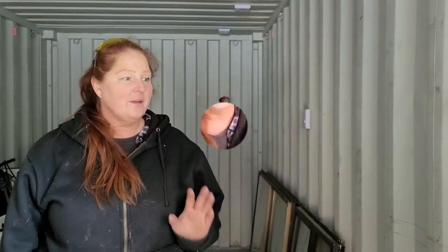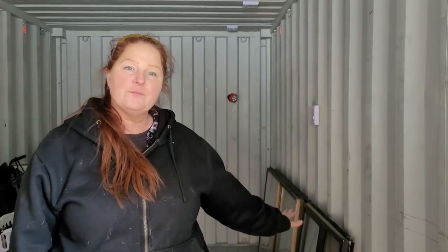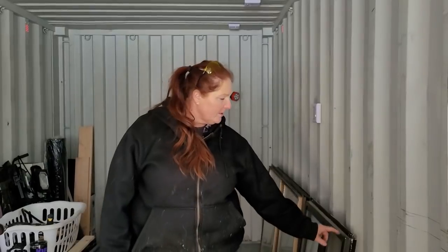A few weeks ago, we actually drew out where we want these windows to go. So let me explain what we did on that. I also have the video that I'll link right here for you to check out of us laying out these windows. Okay, so what you want to do first is measure what is considered your rough cut opening of your window. So basically your measurements of the inside part of your window that will stick into your framing. And that's this line here.